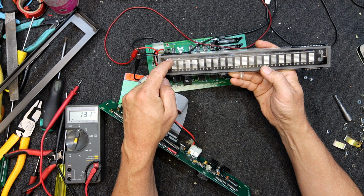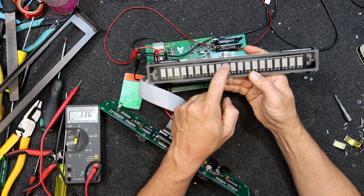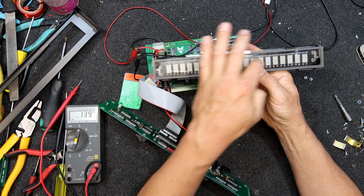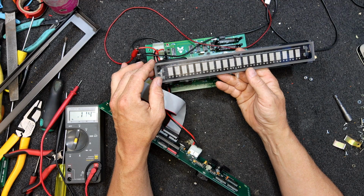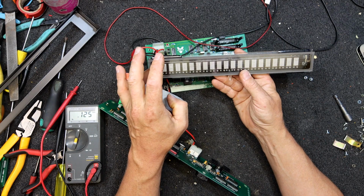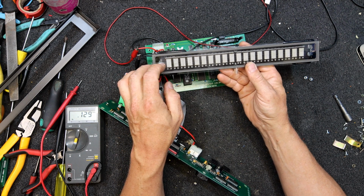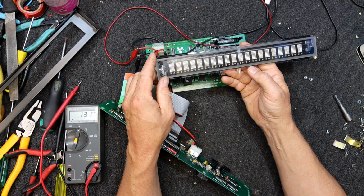So we address that line, turn it on, and we turn all these on for the segments that have it. But if we've got a number 1 somewhere that only uses the row on the back side, that doesn't get switched on that pin down here, but all the others get lit up, and they basically just scan it. So it's just like scanning it, almost like a TV picture tube or something. In a normal 7 segment, you'd be lighting each top whole row, because it'd be 1 segment. And I guess in theory in these, if you're only doing numerical stuff, you could do the same. But if you're doing letters and stuff as well, you've got to address each dot.